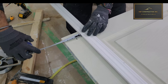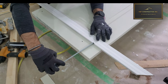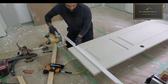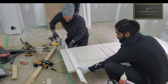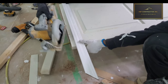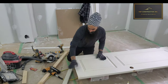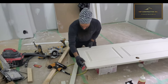Make sure the cut is going to be straight. Once you're sure both ends are perfectly fine, you can use a clamp to hold your guide, or someone can help you out. Once your guide is clamped or held, cut the door. Once you cut the door, you will have some rough edges and you can sand those off.